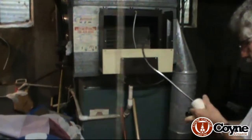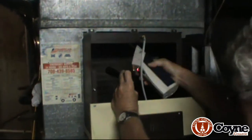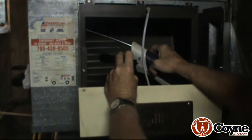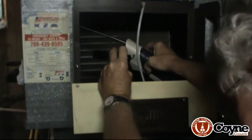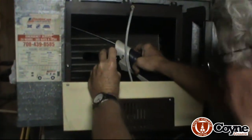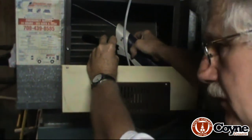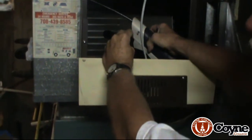Of course, you take out your handy flashlight. What I do is get in here and take my time. I have the customer turn off everything — when I'm on the way to the house, I have the service manager or somebody in the office tell them: shut off everything. No fan, no cooling, no heating. We want the refrigerant to pool wherever it's leaking. If the fan was blowing, it'd blow the refrigerant all over the place.